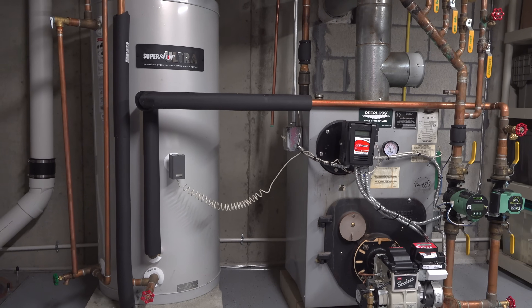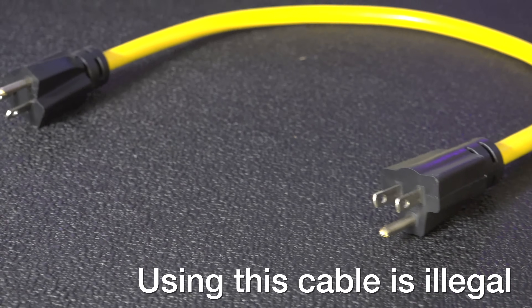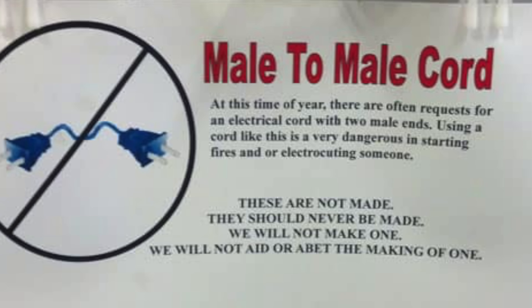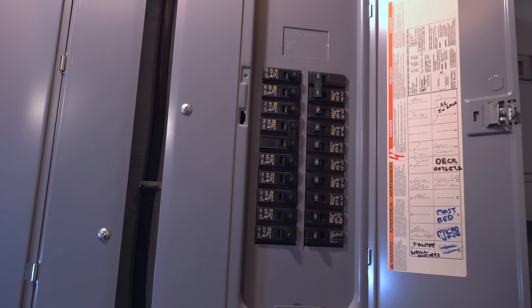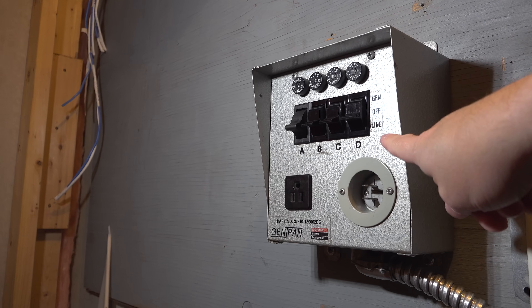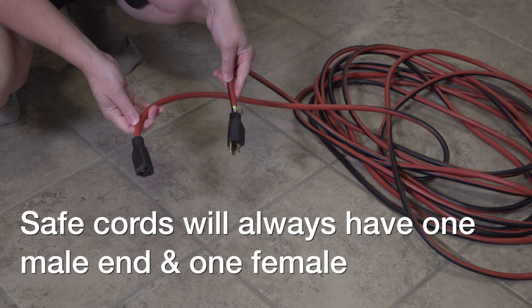This is the only safe and legal way to directly feed power into your house. There is one other way to tie directly into your house, called backfeeding, but it is totally unsafe and completely illegal — you can actually kill yourself or someone else. When you backfeed electricity into a panel, you force it into the electrical system, and it can go back up onto the pole and onto the lines. When workers are on those lines during an outage, that electricity can kill them because they're not expecting any power. The transfer switch is safe because it breaks the connection to the outside world, so your generator's power will never go beyond your house.